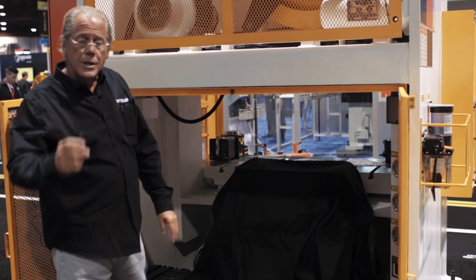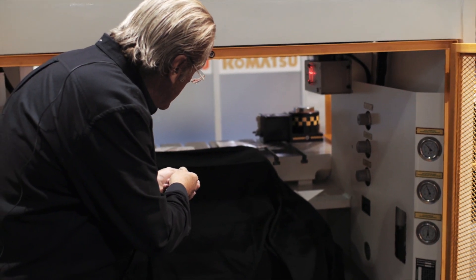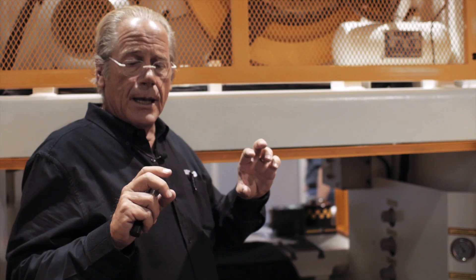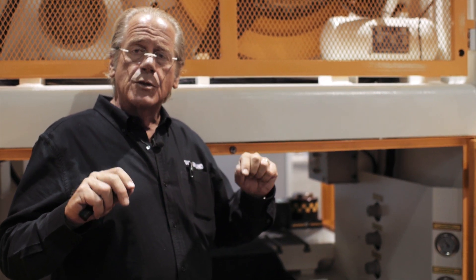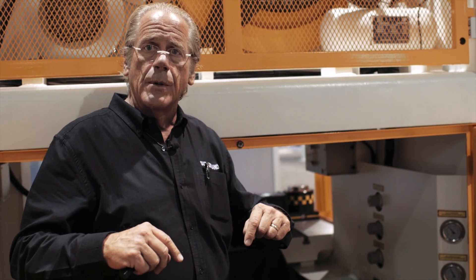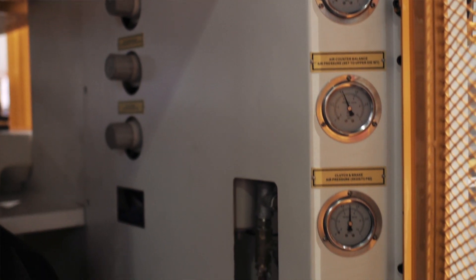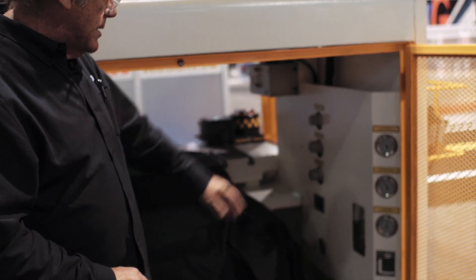Here in the back of the press you've got our hydraulic overload tank and pump system. The importance is when it's full it's to be filled to the halfway point on the sight gauge. You don't want to overfill the overload system because when an overload occurs we need the top half of the tank available to receive the oil coming back from the ball area. And on the two point gap, your air control system is located inside of the guard.